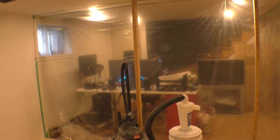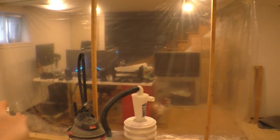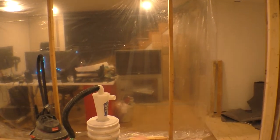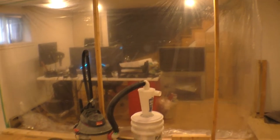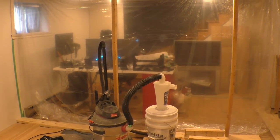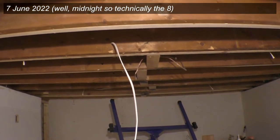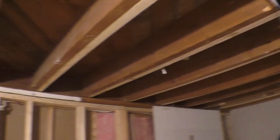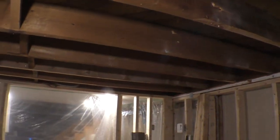I'll do the last part here last because I'm worried about the drywall coming from the staircase. Once I have a corner I'll push the TV and PC desk to have clearance to bring the 4x8-foot drywall in from the stairs. As you can see there's no ceiling anymore — I've stripped everything down and started sistering the joists. I still have several left to do. I've finished the corner here; the heater baseboard can be ignored.